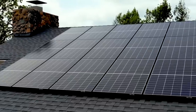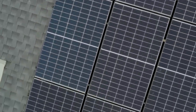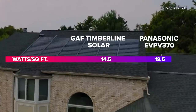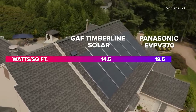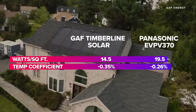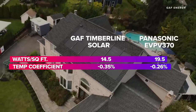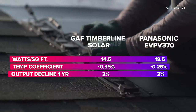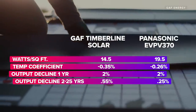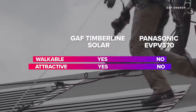It's a little tricky to define a standard solar panel to compare to, but compared to a recently installed system using premium Panasonic rack mount panels, there is a difference in watts per square foot. However, Timberline Solar can cover more roof and doesn't have to leave vacant walking areas that rack mount systems require. The temperature coefficient — the degree to which a panel loses output for every degree above 77°F — is also worth comparing when shopping. Generally all panels lose output as they age, steeply in year one and gradually over time down to a guaranteed minimum at the end of their warranted life.